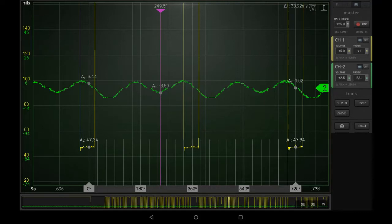Something else that's quite interesting here. This is a 3450 RPM motor, so at that speed one revolution — 360 degrees — is only 18 milliseconds. In between there is that slight movement by the accelerometer; we're capturing that and referencing it to the photocell. Pretty cool stuff. So we have ourselves a three-inch pulley that's good to go.